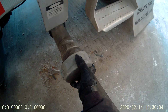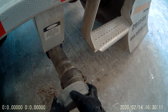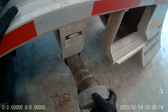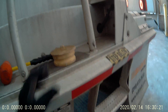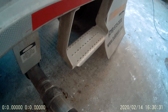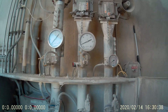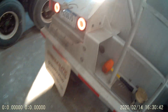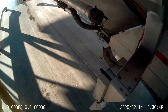Instead of the hose, if I had this cap on here closed — these are called dog ears. Had the dog ears locked on there, with seven and a half pounds of pressure, and I flipped these dog ears back and it hit you in the head, it would kill you. It would be just like a missile coming off there — seven and a half pounds per square inch in a 1600 cubic foot tank. Their line pressure is at three, and I cannot let it go over ten.